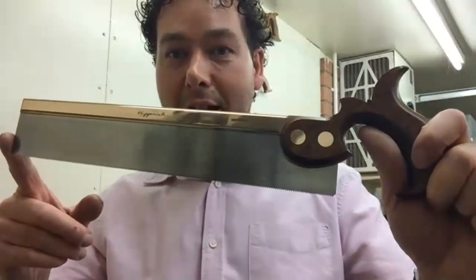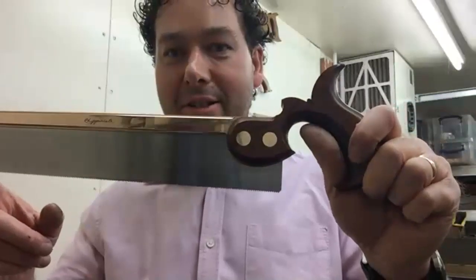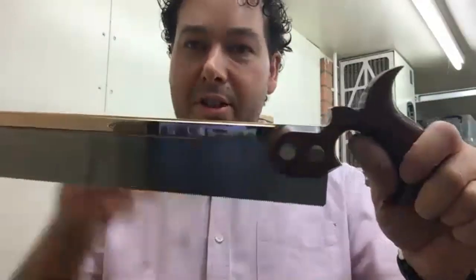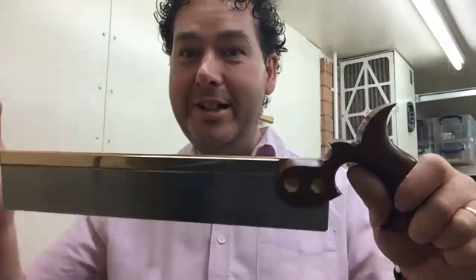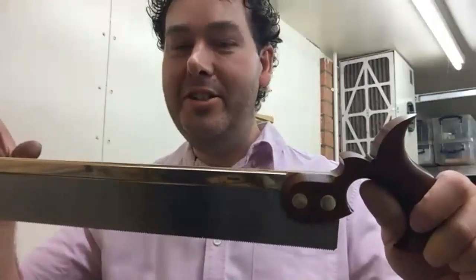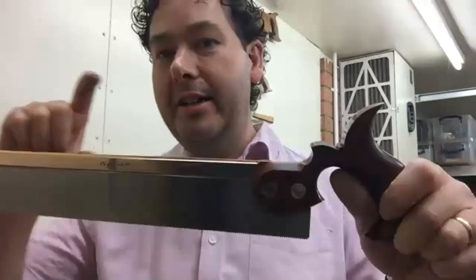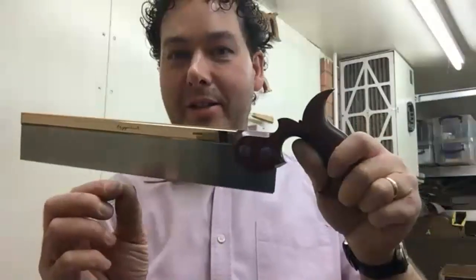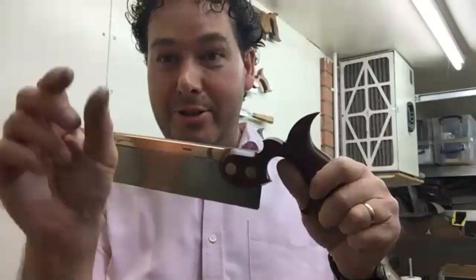We opened it up privately with the collections team, and I examined all the dovetails in that piece of furniture. What I found was that he'd concealed the dovetails. They weren't exposed, like we like to see exposed dovetails. He concealed them so that you couldn't see the joints. But on one particular side drawer, they were exposed, and on that exposed dovetail, there was an overshoot on one of the lines. And that overshoot gave me the kerf width of what they'd used to cut those dovetails.